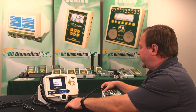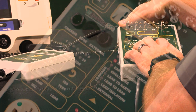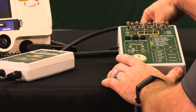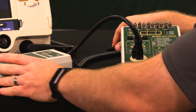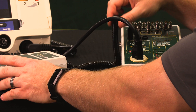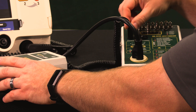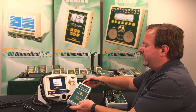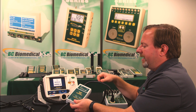So what we'll do is, with this SA2010, we'll first change it to earth resistance mode so that it's configured properly to measure earth resistance. We'll plug in the CS2000 into the test receptacle and plug in the measurement cable to the chassis on the SA2010. These connections are also noted at the top of the CS2000.